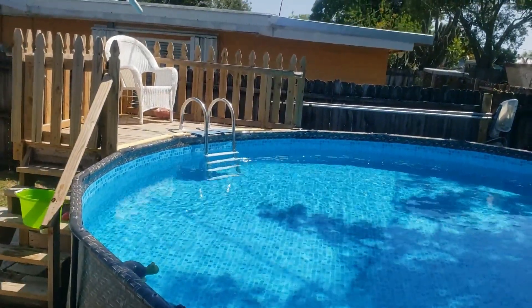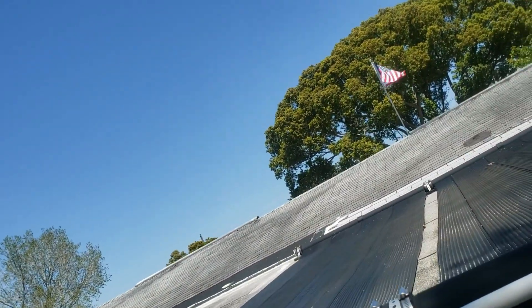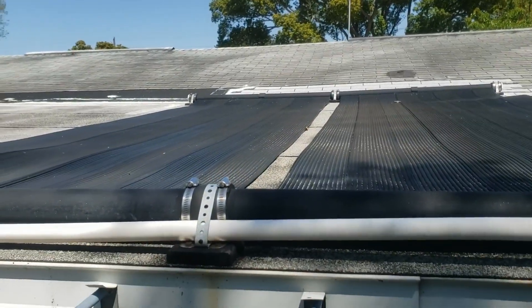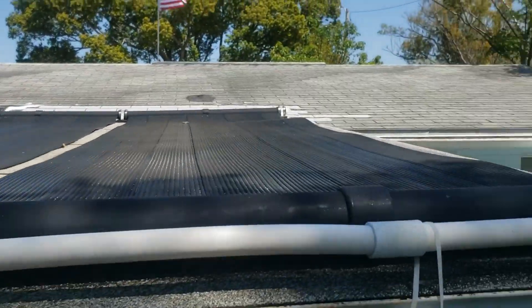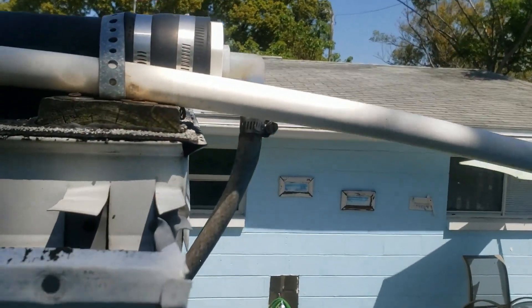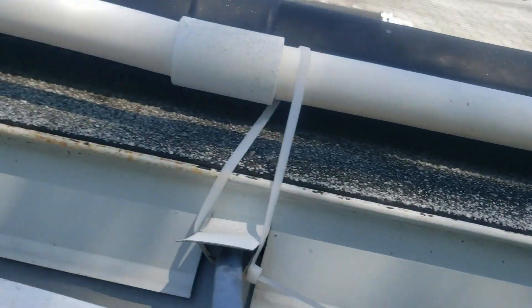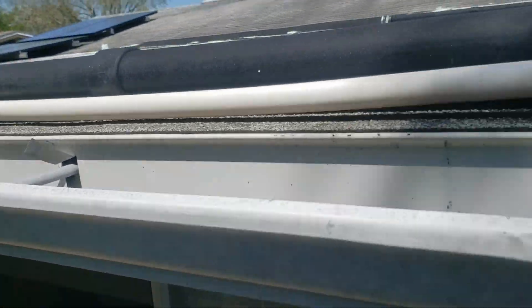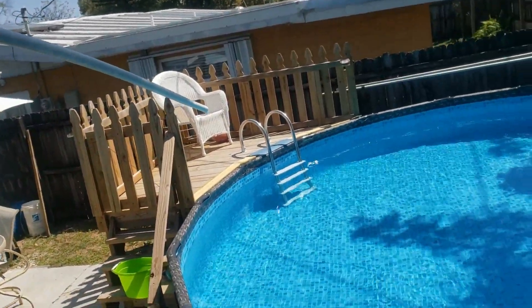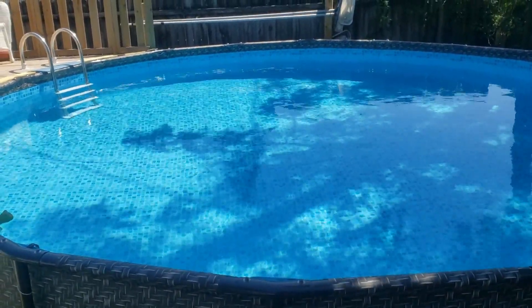So first of all, what it is — and don't mind the jinky setup, but if you want to make your own jinky setup, you can. This is what's up on the roof: two standard solar heater panels. And this is how I have it plumbed. It's just a hose coming into the end — a couple of reducers and adapters. The water flows up through the hoses, comes back, returns out of this PVC line, and then it drops back into the pool. These solar heaters are made for much bigger pools, so just two of them up there works great for us.